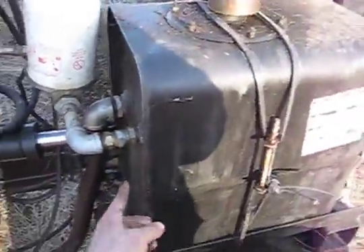You start with the hydraulic pump driven by the engine — a 55 horsepower diesel engine. This is the inlet suction pipe coming from the hydraulic reservoir, going into the pump. You've got this main hose going to the entire hydraulic circuit, so here's the inlet hose for the hydraulic circuit.